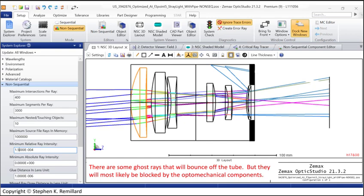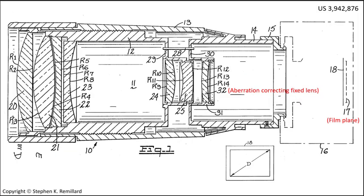Speaking of optomechanics, this figure was included in the patent. The glass arrangement is different, but I think the point was to illustrate the optomechanics. The focusing ring typically found on telephoto prime lenses can be rotated in order to adjust the desired lens separation, which in this case is the spacing in front of the last element. Can you see how all but the last element move as a group as the housing tube is rotated on its threads? I hope you learned as much as I did tearing into this patent. Thanks for watching.